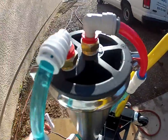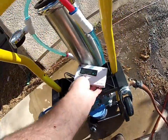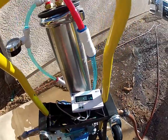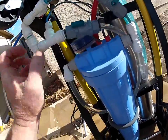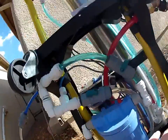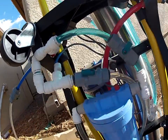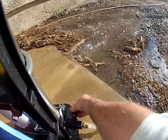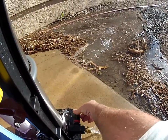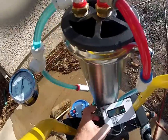I may just do the clear housings so you can actually see your DI, and you get an extra DI with it anyway. That's the new 2500 gallon a day system — the 550 Pro. The wiring is pretty much figured out: blue is your clean water, white is your feed water, red is your wastewater. You can adjust all the systems — if the pressure is a little low you don't have to run just DI. Bring it down to yellow and you always have water coming out.